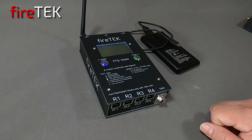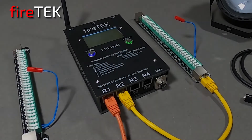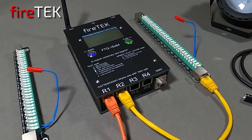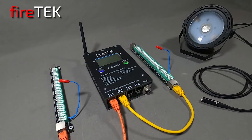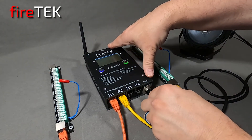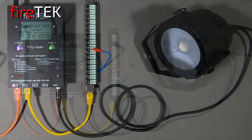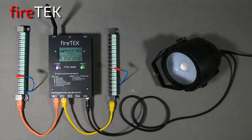Internal to the module is the FireTech power board with 1.5 Farads of capacitance, providing up to 28 volts and up to 10 amps of firing power, allowing it to fire up to 10 igniters in parallel or 25 in series. The FTQ module can be optioned with DMX, allowing the operation of flame machines, CO2 devices, lights, and other compatible items. The FTQ script now includes DMX value ramping to allow smooth dimming and motion control, and the script now includes additional product and zoning options that both aid in the setup and allow quick disabling of safety zones.